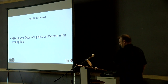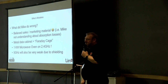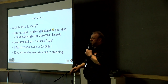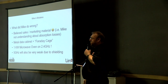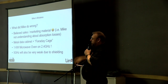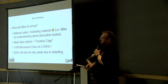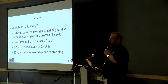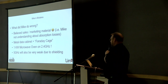So he phones Dave. Dave points out a few of the mistakes. One thing he did was believe the sales and marketing material — because that assumes a perfect world, like being on an airfield on a runway with the access point on a six-foot pole, driving away until the Wi-Fi drops out at 600 feet. There's a slight difference between what a technical engineer says and what sales and marketing say. Also, he put it into a Faraday cage — the steel cabinet. Even if it has a glass door at the front, all the other sides are metal, shielding it in every direction.